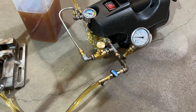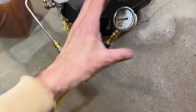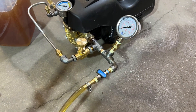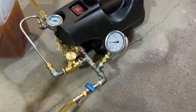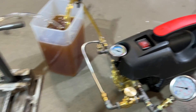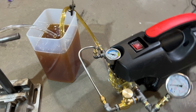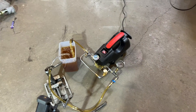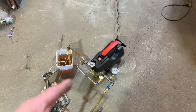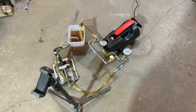If you're a customer watching this video and you buy this product, you are going to have to put this section on yourself because shipping it like this is in a very fragile condition. Only this component here on over will be connected in shipping. This thing's very heavy and very capable of damaging itself. When you go to prime it, you're going to want to put some oil in the hose directly with a funnel or a syringe because you never want to dry run this pump when you first get it, or it will damage the O-rings in the piston pump. This is a positive displacement piston pump, and it's run by an orbital swash plate — there's a swash plate in there that kind of rolls around like this, for the lack of a better description.